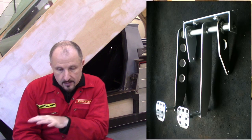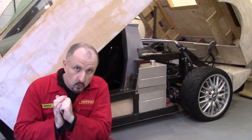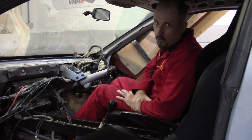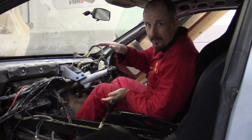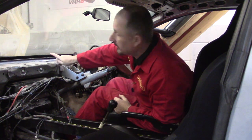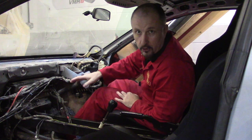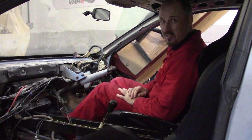There it is all back together again in the new assembly. There is still one more issue with the clutch pedal. The pedal itself I had to shorten — there's no getting away from it. Even though I moved the upper pivot as high up as I could — it's virtually as high as it can go — and this pedal is as low as it can go, otherwise it becomes uncomfortable and unusable. However, when I push my foot on the clutch pedal, it's still pretty stiff.